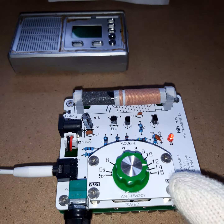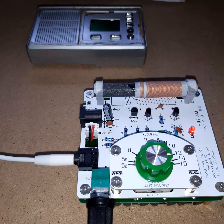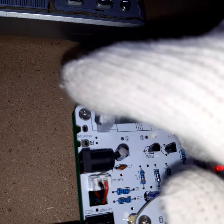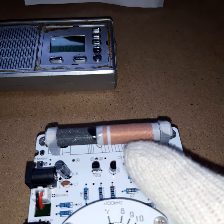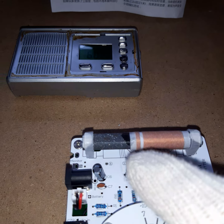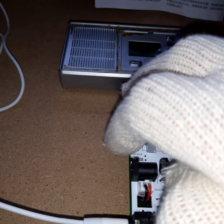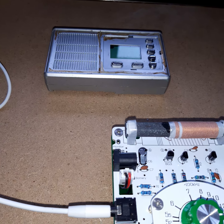I did some longer tests outside this video with this device. And now we have another thing here — it says 'monitor.' Here you can see it: these two connectors. What they do is offer a connection where you can solder on a shielded wire and connect it directly to your vintage radio. You can see there is the main coil, the big coil, and apart from it is a small coil — the coupling coil. What the coupling coil does is take the signal from the ferrite rod and convert it into a voltage and apply it here, so you can connect it directly to your radio.